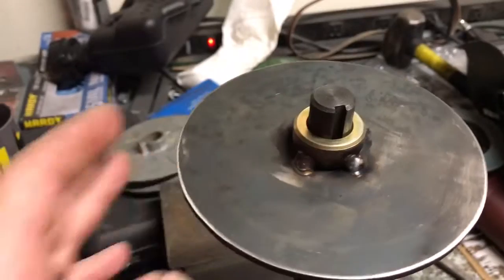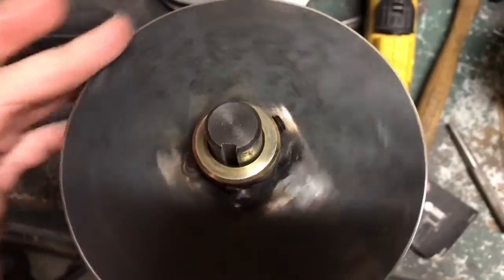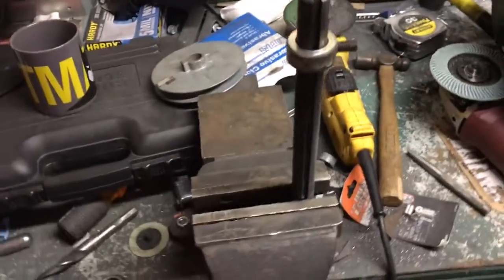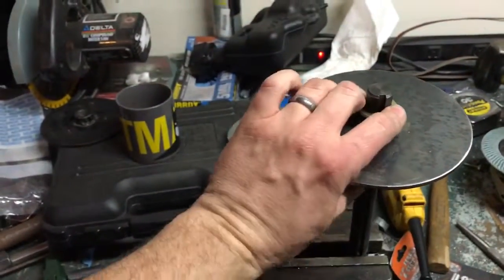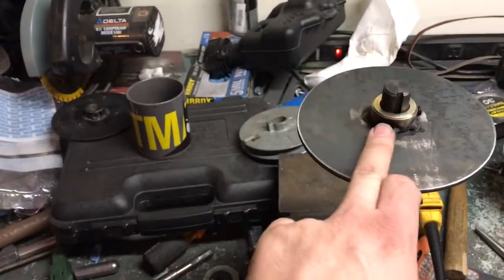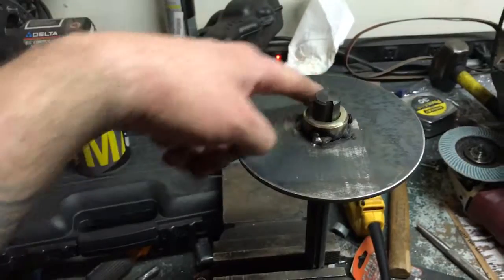It's pretty straight, doesn't have any wobbles, and it's almost perfectly round — not quite, but pretty close. Anybody can do this. The best way I found to do it: I have a piece of keyed shaft, I put a collar on, put it on, then put another collar on to sandwich it together, tighten the set screws down, and do tack welds — one here, then go to the opposite side, then the opposite side again, and let it cool.